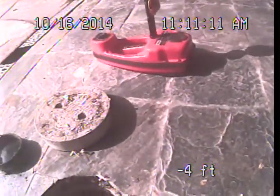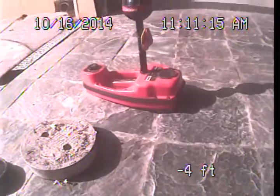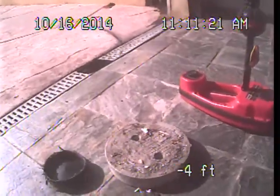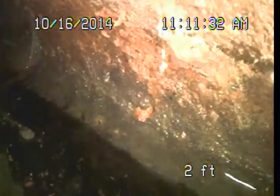As soon as we drop into that main drain line, we're going to change into a vitrified clay piping. It's actually right here underneath the second row of tile where you see my locator. Discuss that here in a second. We're going to drop into that main drain, essentially making a U-turn.